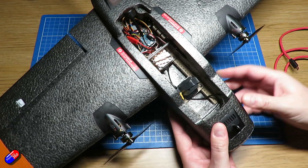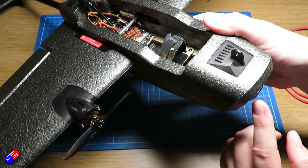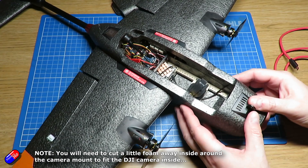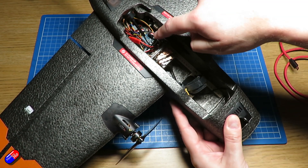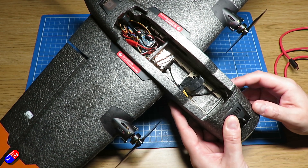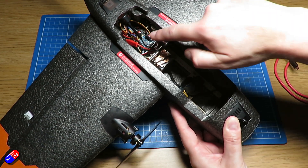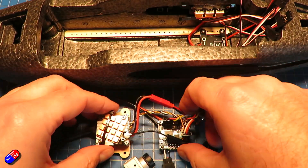I've used a 20 centimeter extension cable from the air unit light to the camera that's in the nose - I've put my camera in here rather than on some kind of mount on the top. The limit I could get with that cable wouldn't quite let me get behind the flight controller, and wouldn't let me get all the electronics far enough back with enough room at the front. So in the end I swapped it around - I moved the power distribution unit that comes with it back and put the F411 WSE on top.